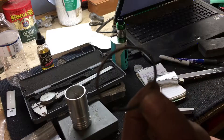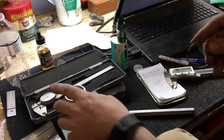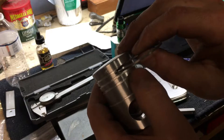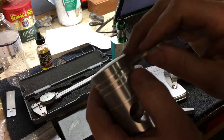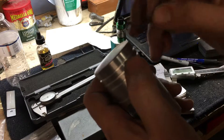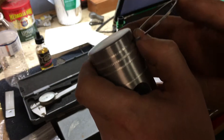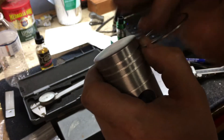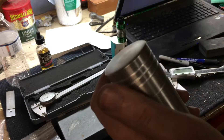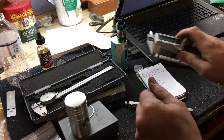I've got the rings and I've measured them to be 58 thousandths, and scouring the internet for ring clearance, I've discovered that the depth should be deep enough so the ring does not protrude when fully compressed. All I've got to do is measure this and run my compound in that distance, which I'll set up with a dial indicator. The hardest factor is making sure that the gap is wide enough so that the rings don't tilt back and forth — they go straight. The ring manufacturers suggest 1 to 2 thousandths clearance. I'm going to go 1, optimistically thinking I could get 1 and end up with 2 most likely, so that gives me a 59 thousandths gap.